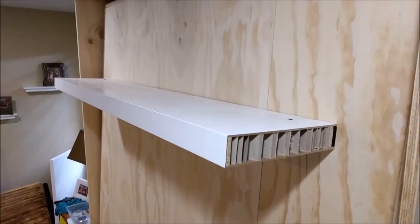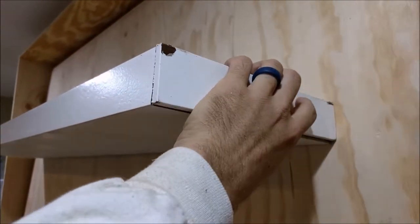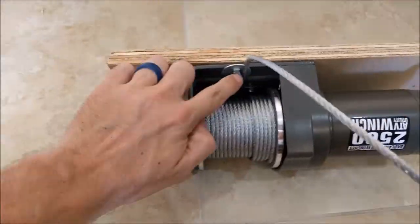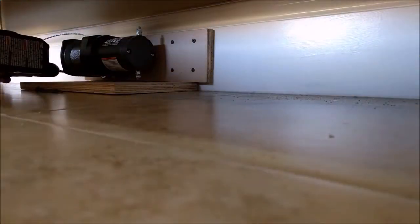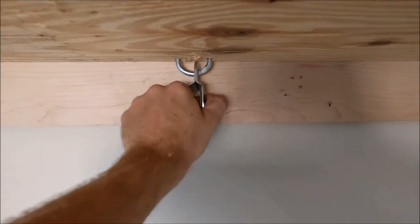To make the foot for this bed, I used an old floating shelf that we already had, but it was too long, so I just chopped off the ends and saved the capped pieces so I could glue them on and make it look good later. For the winch, I plated it and attached it to the baseboard for extra security. I also put in a U-bolt at the top, which holds the pulley with a cable that runs through and attaches to the foot of the bed.